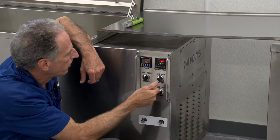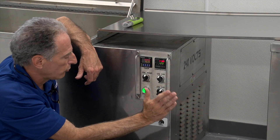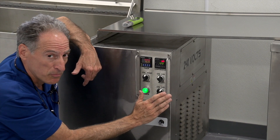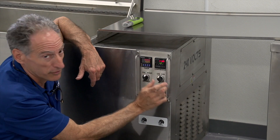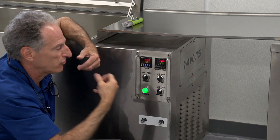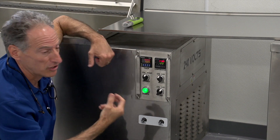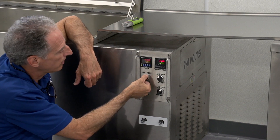So we talked about power. I'm going to go ahead and turn it back on — right now I'm set at full power. I'm going to reduce the two knobs to 75%, then to 50% power, and then to 25% power so that you can hear the difference. Obviously you won't be able to put your fingers into the machine to feel the difference, but the feel, the cavitation energy, and the sound are all related. The lower the volume of sound, the less energy I'm putting into the tank. We're going to start at 100% and reduce.